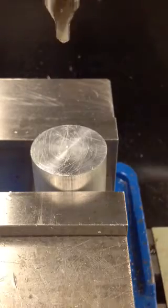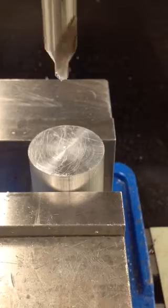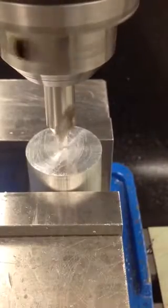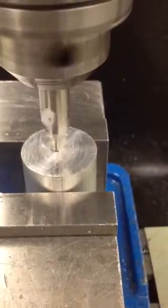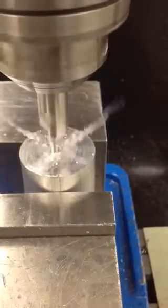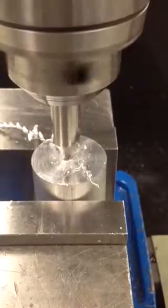On this video we're going to look at the G82 center drill cycle using the P drill. We'll drill for a couple of seconds just so you can see what it looks like. Using a number eight center drill running approximately 200 RPMs — rather slow. The larger the drill, the slower the RPMs will be. Smaller drills will run extremely fast RPMs.